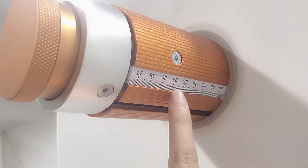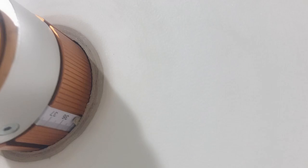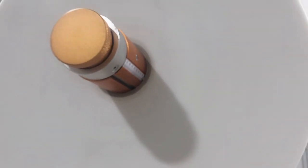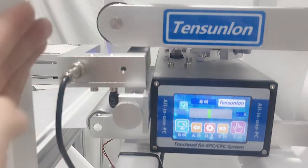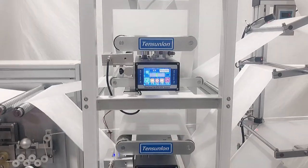We can see here there are some clear numbers. If we pin it this way, then this can move. And if we pin it like this, it will be locked. And here are our fabric correctors. They manage to adjust to avoid fabric deviation — they go two left and two right. Here we use just four pieces, but for five layers, that means we have to use five pieces.